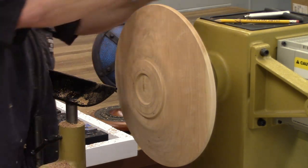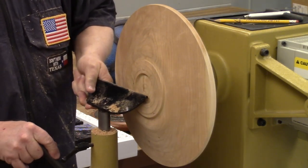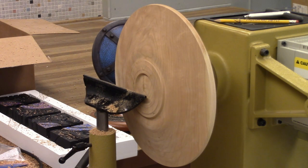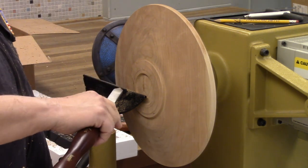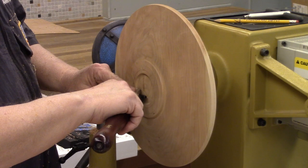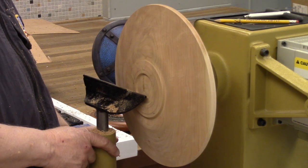I still have not dressed this recess to where I need it to be. It still needs a little bit of a dovetail in there. I admit I have an addiction to tools. All I use this for is tenons and recesses, to give me the dovetail I'm looking for. One use tool, and I bought it. You can make it yourself if you get the right dimensions of your dovetail. All you need is some time on a grinder.